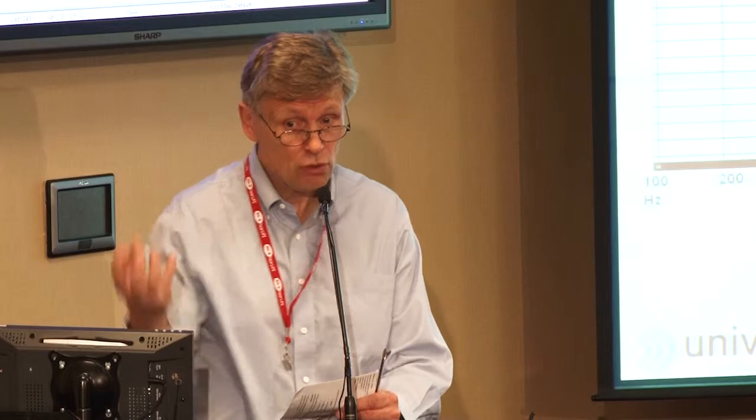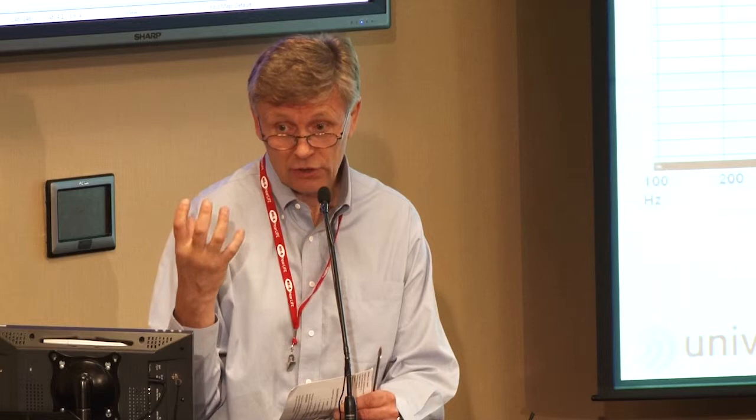Yes, it is weak, but according to the meters, it's minus 6 dB, so it's usable, but I would say it's weak as well. It's not the optimum anyway. Right. But what it actually was, and that's the reason why the meter shows a little better than you distinguish by yourself, high frequency cut. We cut the high frequency very much, and then you will hear it badly, but the level is actually reasonably good, but for low frequency. So that was a tricky one. Shame on me.